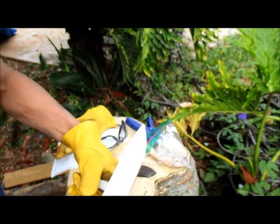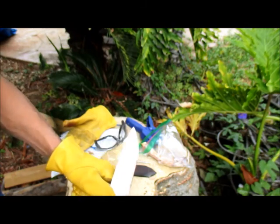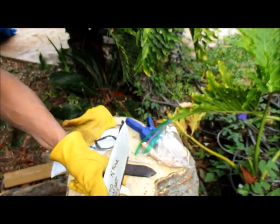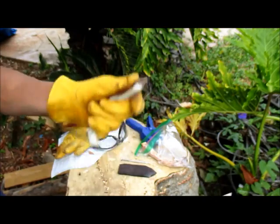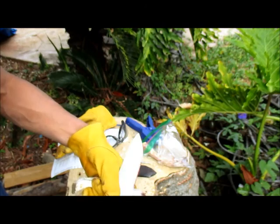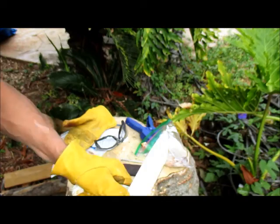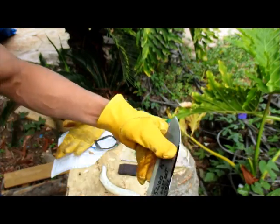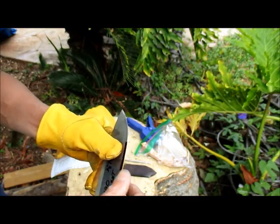So I just start out whittling the bone, and that is the outside, and then I go from the edge, and you can see it explode out a little bit, though it's really hard at your edge. And then this inside, you can see the brittleness, it kind of explodes out. And then you usually have a loupe, and you can actually look into the edge and see, did I damage it? Is there a microchip or a roll?